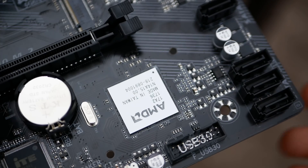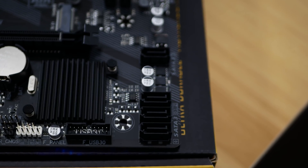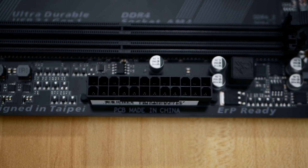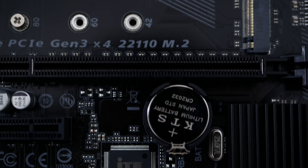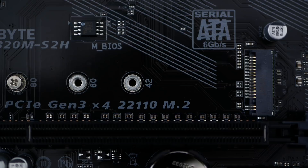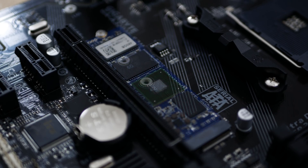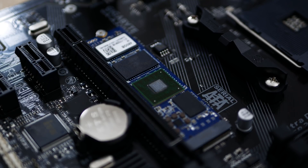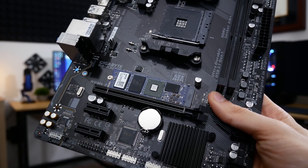There's also an RJ45 port packed with the Realtek Gigabit LAN driver. The remainder of the board's layout is fairly straightforward. The A320 chipset resides under this small heatsink. Four SATA 3 ports are staggered to the right, and the 24-pin sits in its usual spot, along with an 8-pin EPS up near the top left. Another peculiar feature of this board is M.2 support. Ryzen processors can drive a PCI-based connection for use with significantly faster solid-state drives — something I did not expect to find in a $50 board.